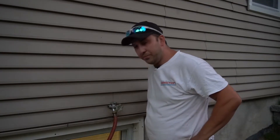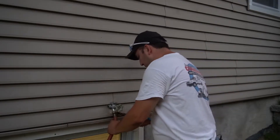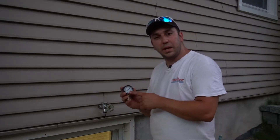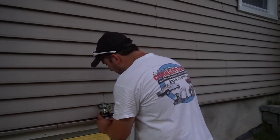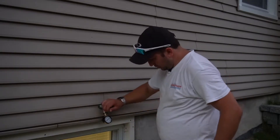We're back at the house. We're going to check this outside spigot. This spigot is connected to your entire water system, so any pressure from the main to the spigot, we're going to read. We're going to screw on a 200 psi gauge. We're showing 29 to 30 psi, so we're well within our working pressure — that filter housing was rated 125 psi max. We're good here. Let's undo this and head back down to get started.